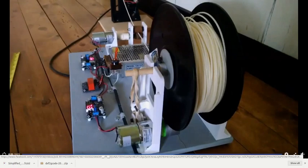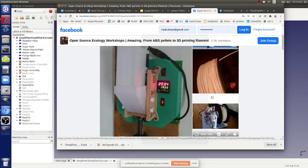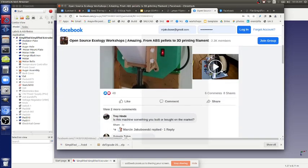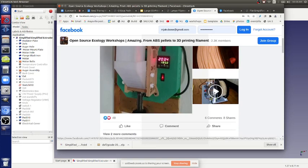One consideration in regards to printing lumber and such: for internal walls, non-load-bearing, that's totally fine. But even if it is structurally sound, there is no code around using plastic structural lumber, and that is a major stumbling block. We have to develop that process as well. For this to be used in anything but non-structural or decorative uses, which is still decent, like trim or foundation forms, it means going through the building department and code authority approval. So testing and data collection, that's part of this game. Which is going to cost like $1 million or so once, and then we have it, and then it's open.